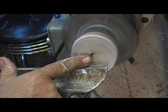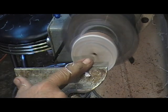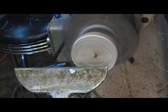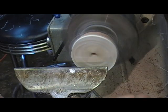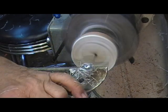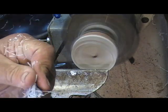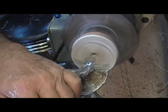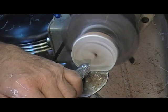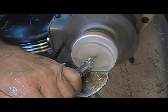This surface is flat, and except for that little dimple right there, it's in really good shape. But I have found that this does not really lend itself to good optics when you're looking through the lid. So you can play with either convex or concave, and it changes things a little bit. Choose to do that, you're going to scrape this out. To scrape this out, I'm going to again use my 18 millimeter round. There's nothing magic about this, except the price, because I have them cheaper than anybody else on the entire planet. But I will put it up there and do some light pulls.